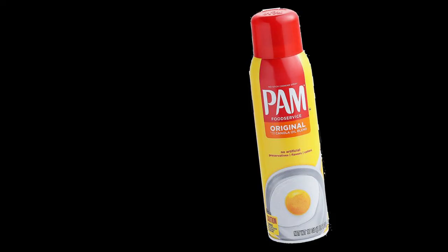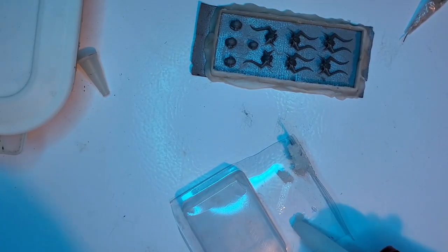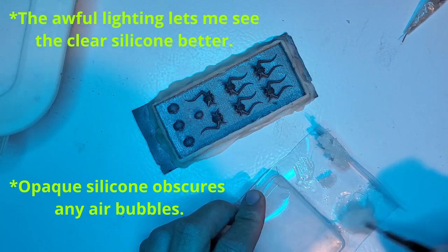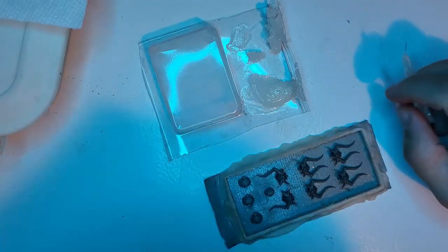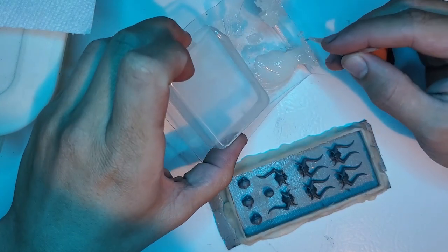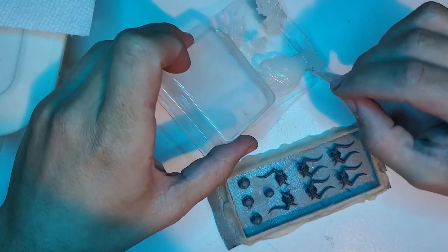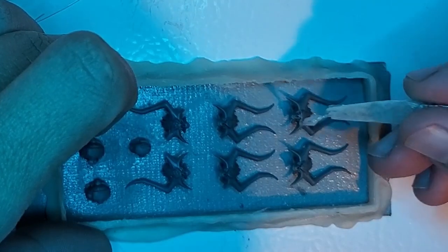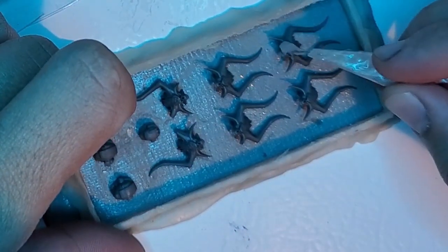And a release agent of your choice — just wash everything afterwards. Straight out of the tube, silicone caulk isn't that well mixed, so we're going to start by manually mixing it. It also puts a little bit of oxygen into it, which helps the curing process. So it's kind of best to do this in layers. The silicone will stick to itself even after it's partially dried, but in this case I happen to do it all in one sitting — because I'm reckless.